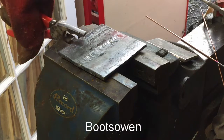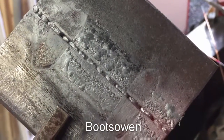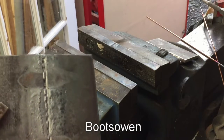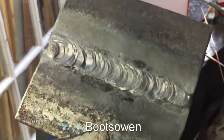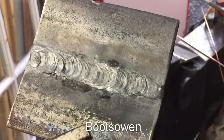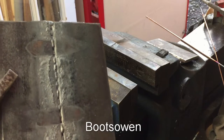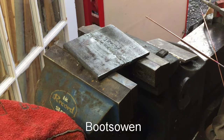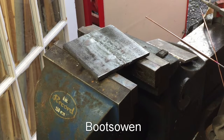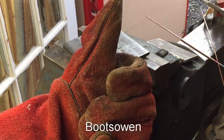I have no idea what that looked like on camera, but let's see what the weld looks like. It's pretty mixed penetration there — beads of penetration. What I've got to say about this is you can see the heat sink marks from where it was resting on the vice. That's the most successful weld I've had dialing it in by ear. I've been trying to use the gauges visually and it was an absolute nightmare. I'm really quite pleased with this — I'll probably just run along the back of that for practice. That seems to work now, but it's just strange to me that the Integra cylinder oxygen gauge is so bad. If you've got any questions or comments, stick them in there. Thanks for watching, see you later.